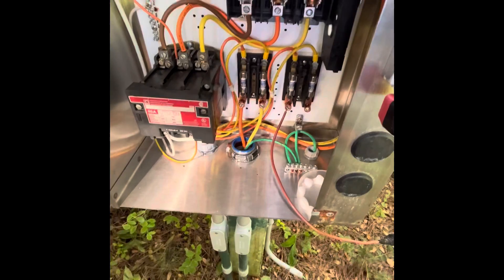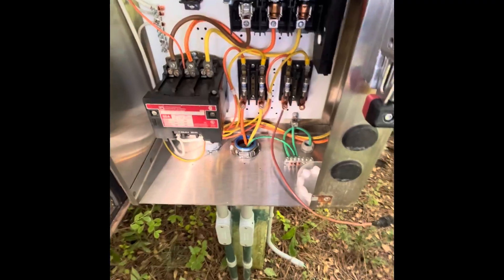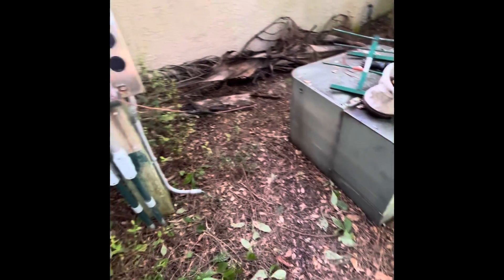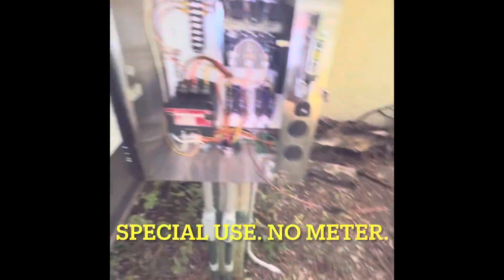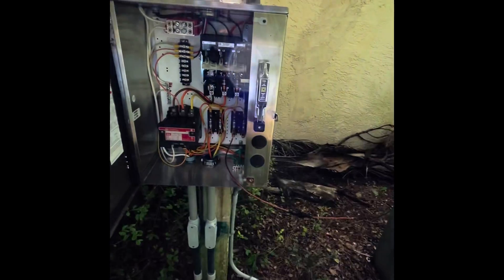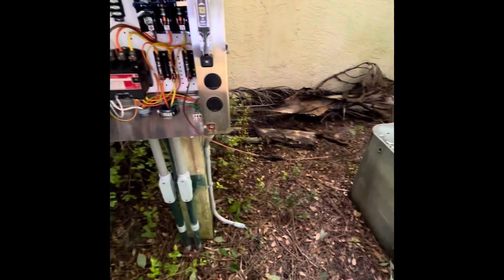When I told you I was gonna use 120 volt, I lied — I'm gonna use 240. This is a single phase system. There's the transformer, there's the service disconnect. It's for street lights only, as you can see from the label. This is a special use transformer, there's no meter. It only runs about 20 street lights, a mile in one direction and about a quarter mile in the other. But it is single phase — I cannot express that enough. I know everybody's gonna be like 'that doesn't exist' — it exists. Just accept it.